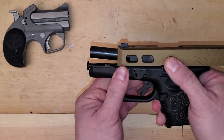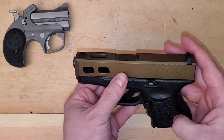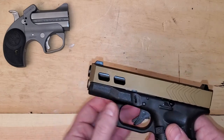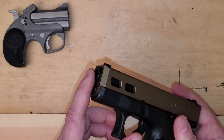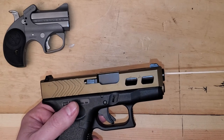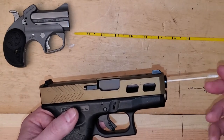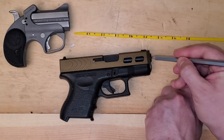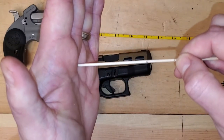For a semi-automatic pistol, for a semi-automatic rifle, for a bolt-action rifle, for anything that reciprocates — that could be a pump, it could be a lever gun — anything where the bolt or slide reciprocates, you're going to measure from the end of the barrel to the breech face. The easiest way to do this is to have the gun unloaded and closed. And again, insert your dowel rod. If this was a rifle, you'd really have to do it this way. My little eight-inch zip tie doesn't work for rifles, but it's great for handguns. You'd insert that and again make a mark — hold it firm against the breech face and make a mark. From that mark to the end would be the length of the barrel.